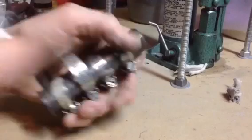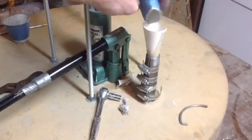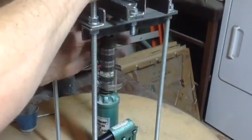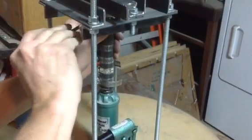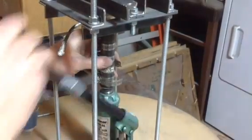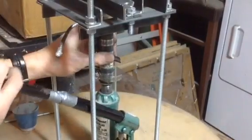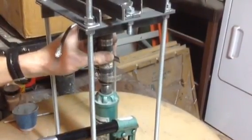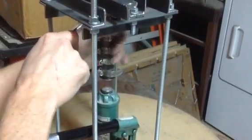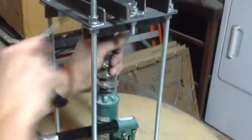The PVC is put into a split pipe nipple and secured with hose clamps. A paper funnel works a lot better than plastic as they're non-stick. First I'll put in four grams of the nozzle mix. The first die that goes on top is steel but has a hole in the middle so it doesn't damage the nozzle-forming pintle on the bottom. The video shakes a bit because I've got the camera on a cinder block on the same table as the press. I achieve full pressure and hold for a few seconds to allow plastic flow and density gradients to equilibrate throughout the powder I'm consolidating.